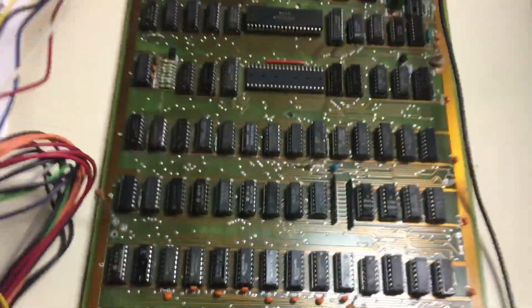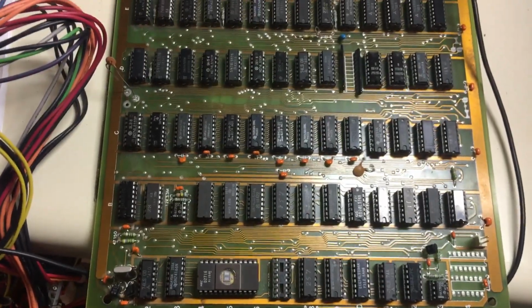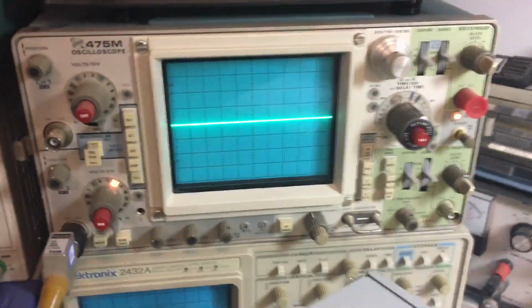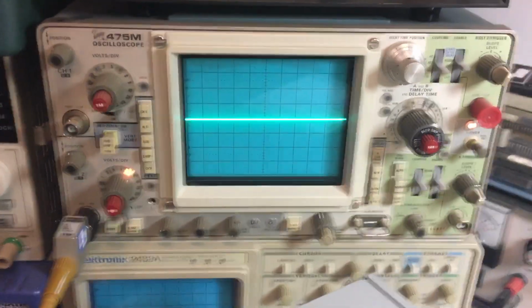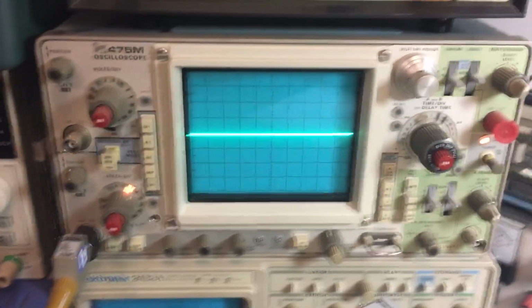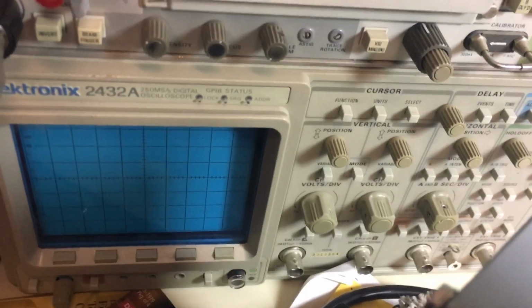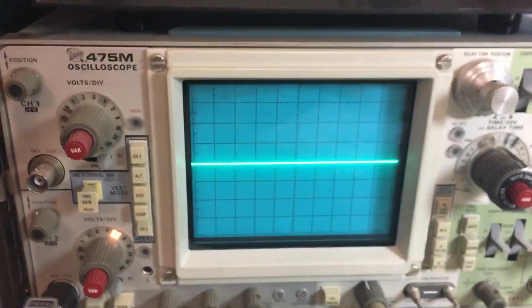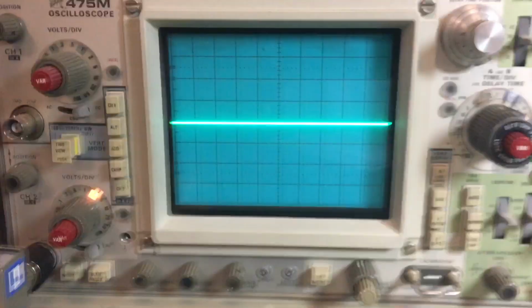And if you're going to do this kind of restoration work and try to debug this stuff like Adrian does at the Digital Basement, get yourself a cheapo scope. You don't have to go digital. In fact, for this kind of work, I actually like my old Tektronix because you don't have to fiddle around trying to set it all up and get the programming right. I do have another Tektronix digital capture scope down here, an old dog that's digital, still tube, and I love that thing. But for just this kind of work, when you want to look at some signals, it's nice to have just a general scope.